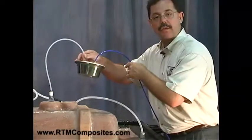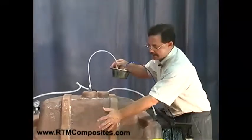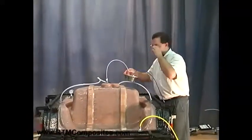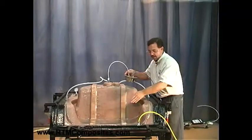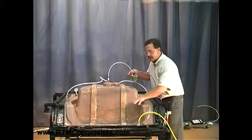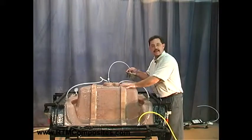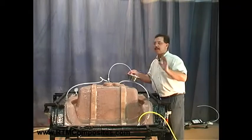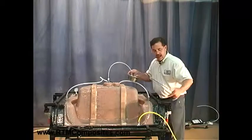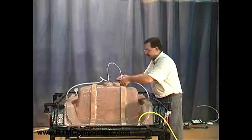Now that's obviously vacuum locked together. This blue line is at a half a bar, so that means this entire cavity area — remember that resin channel seal, the dynamic seal — is sealing off that high vacuum in this area, and the wing seal is sealing off from atmosphere. That's one vacuum environment. The second vacuum environment is in this cavity. It sounds confusing, but it's very simple: you simply have a full vacuum line and then a regulated vacuum line, and that's all the connections that are needed.